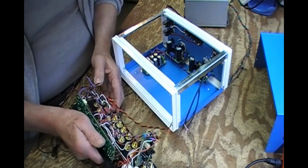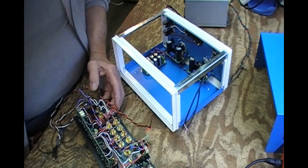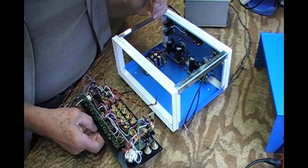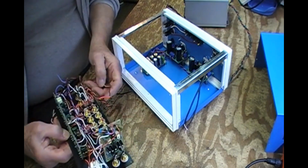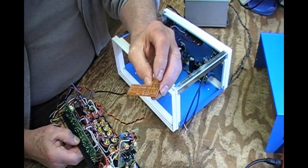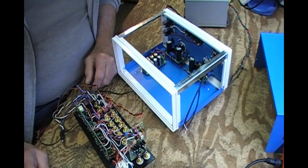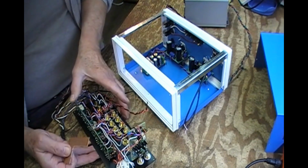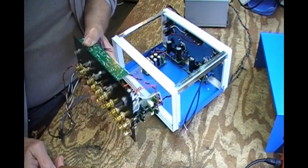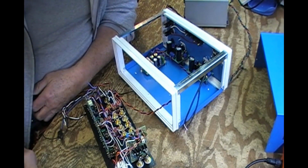And there's also one more big thing that I have not done, and I think I'm going to put it together without it, because I have to build a circuit on this perf board that will accomplish an RIAA simulator, and it goes out on these jacks here for when I want to test an amplifier's phono input.